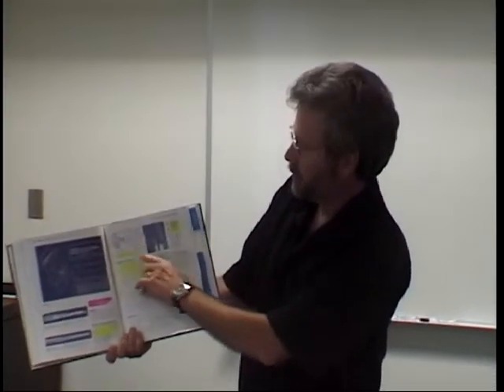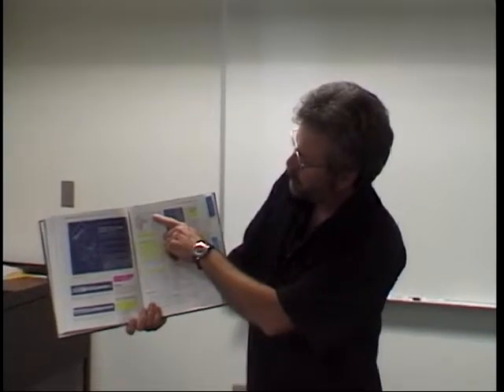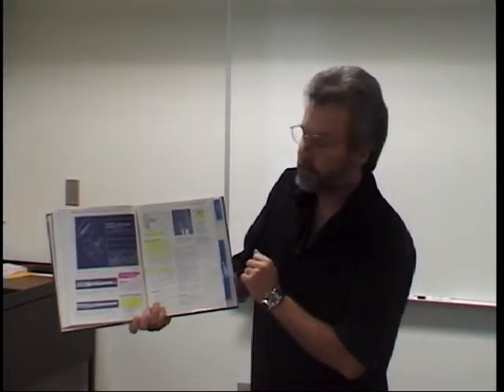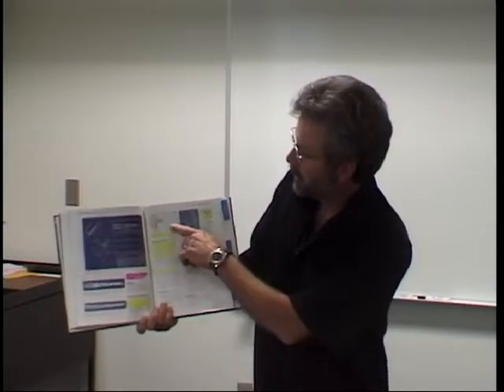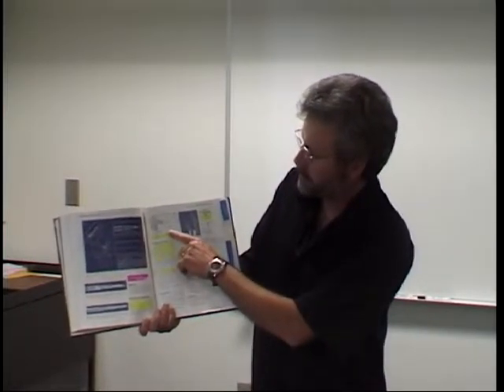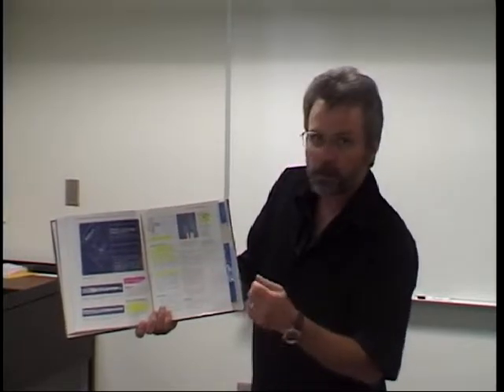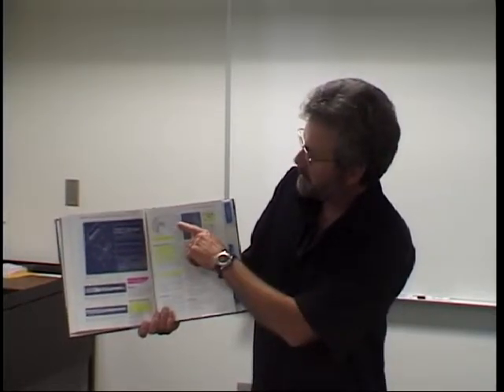Go to the next page and look at figure 1369. There's more than one way to make a weld. What they've done here in this figure is given you some different ways that you can manipulate your welding electrode. You can see you can have a steady push, which we would recommend if we were putting a stringer bead in a pipe. Sometimes we'd use a slight whip — a whipping motion, which you're practicing now. You can use a J motion or an inverted T. You could use a box weave. The weave that Jeff and I are teaching you is the Z weave.